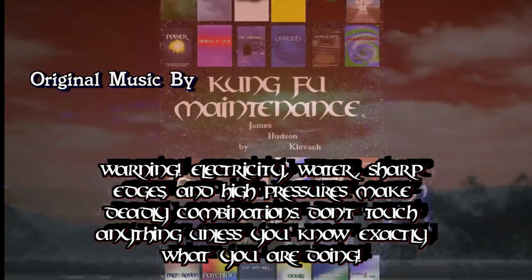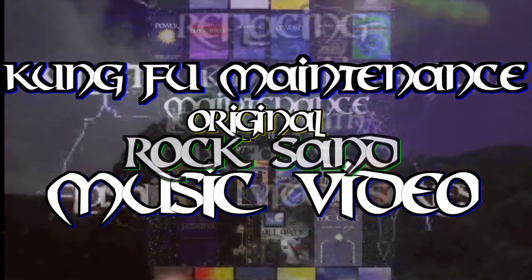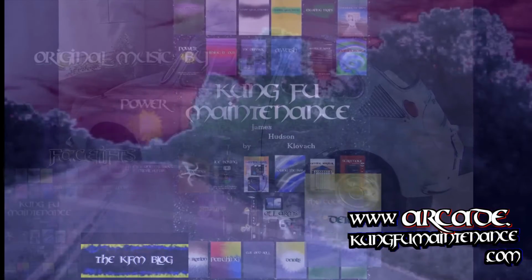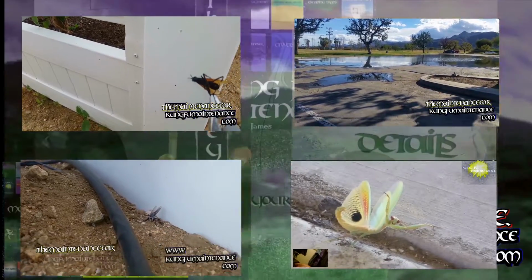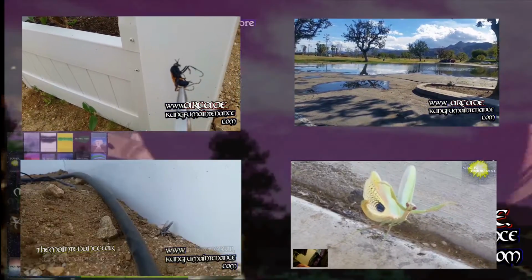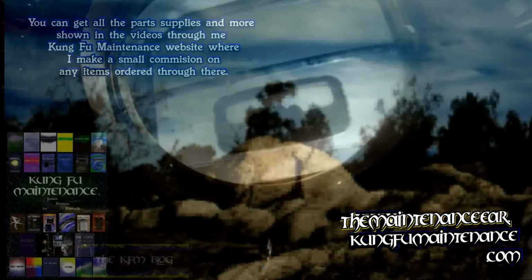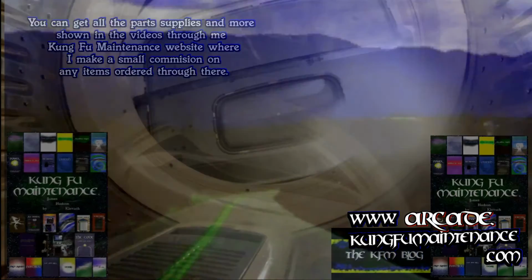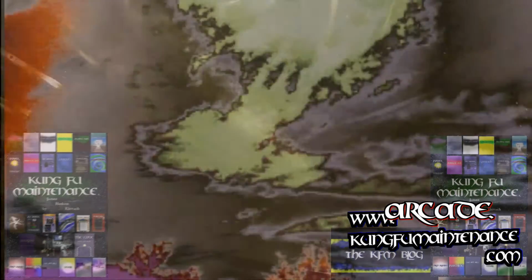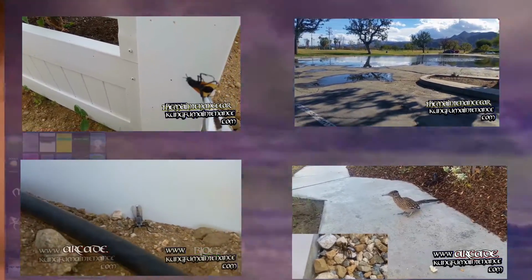That's the value of the pressure test. And it can prevent a lot of property damage. So now you see why it's so important. Pressure test. And it doesn't hurt to test the other side in similar fashion, but on that side you won't be able to run the disposal. You can just fill it with water and then pull the plug. At least it'll give it some pressure to test the other side. But for the garbage disposal side, the pressure test works great. You can make any little tiny leaks show up right away. You can prevent property damage and have people happier with your repairs.